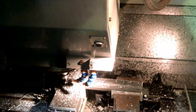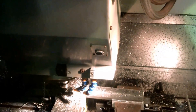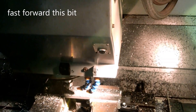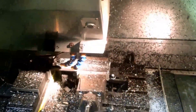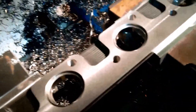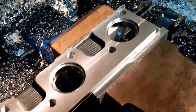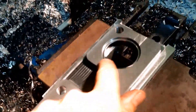The other thing when you're doing a program like this - not big, but for a FANUC Zero-M controller it's big. They've got fairly small memory and this has been maxed out on the memory size. That's finished. So that's your 2D adaptive clear through there. We've all done the deburr chamfer operation.